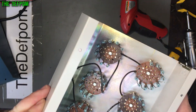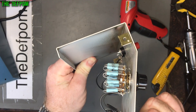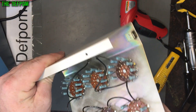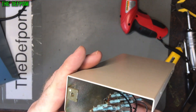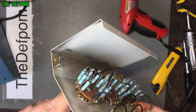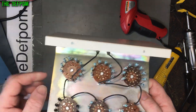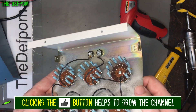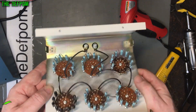I can see some grease in there - it's probably a bit dry. I'll give it some contact cleaner, maybe some alcohol to flush them out a little bit, and then re-lubricate them. It's all nice and tidy. I'm just glad there's no burnt-looking ones because that's always a sign of being abused, but this looks really good - very good indeed.